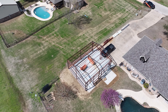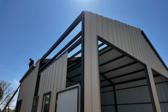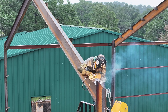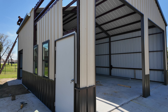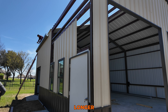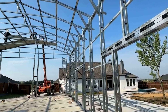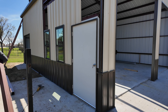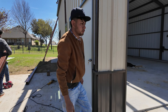Check out the side before we go inside. This is a weld-up building — we started last week on Tuesday and had some rain. A 30 by 36 with 14-foot tall on a tubular would have been done in about three days. Weld-ups are fabricated all on site, which is why you see all the scrap out there — all the angles and cuts are done on site. Bolt-up buildings from tubular or red iron are fabricated at a shop and come as kits you just put together.